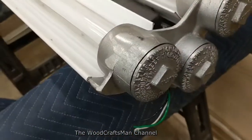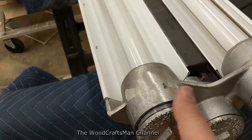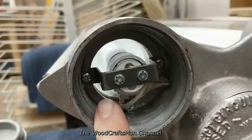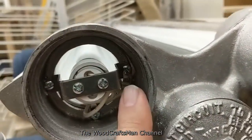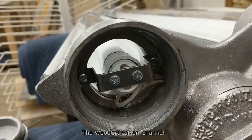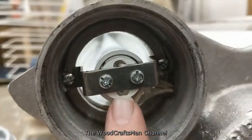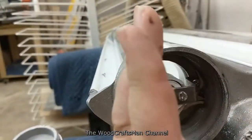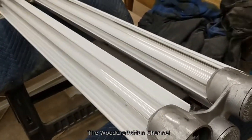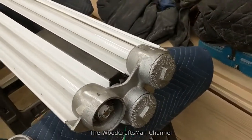Getting over to making this an LED bypass — there's one thing they failed to tell me that I didn't realize. Basically, what you do is loosen up this screw, loosen up this screw, twist this, pull this off, and the bulb will come out and you can replace it. Now, if you look at the wiring configuration here, the wires are on top and the wires are on the bottom — that's actually where the pins are. So the pins are oriented like this. The interesting problem is that on any LED ballast bypass, the pins are laying 90 degrees to that.